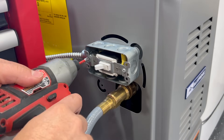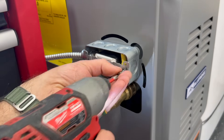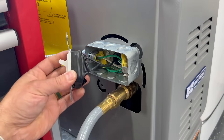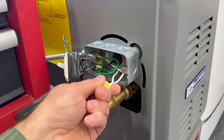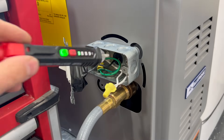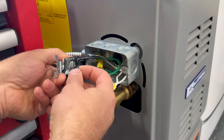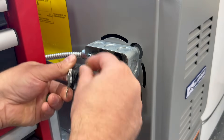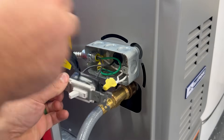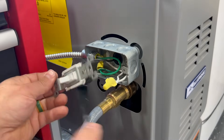Next, we'll take our switch out — just pop these screws out and slide the switch out. This is probably what you'll see: just two black wires connected to the switch. Your neutral will be wire-nutted together, and then your ground as well. We can go ahead and check closer up to make sure everything is dead. Then we'll completely disconnect our switch. Something I like to do on any outlet or switch is wrap the exterior with tape to make sure it never touches anything — just a good practice to get into.